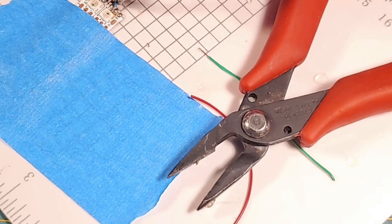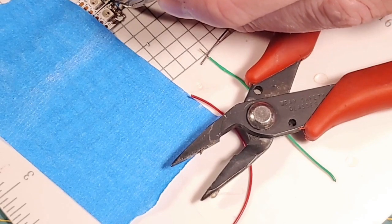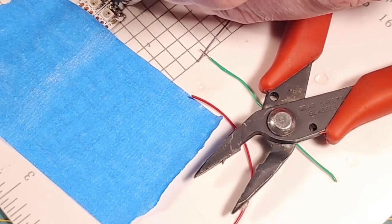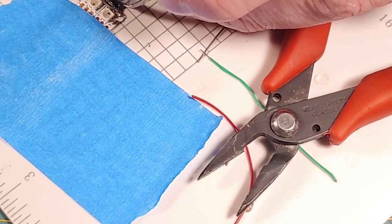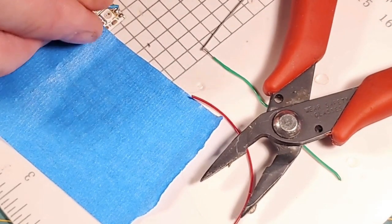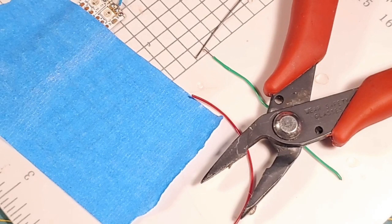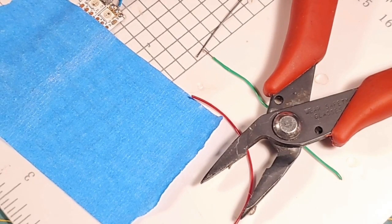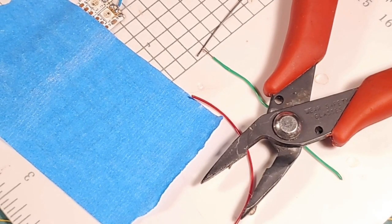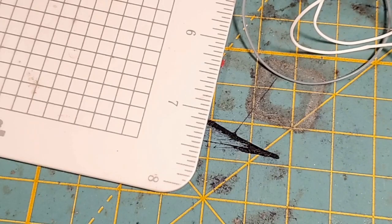The hemostats. Oh man, that's a small wire. I think I can make that work. Oh, let's clean that off. So there is our data connection. That's good. Now we need to go to our positive connection, and the positives are just going to be bridged right there. But since the positives are so close, I can just bridge them, and then it's going to terminate.